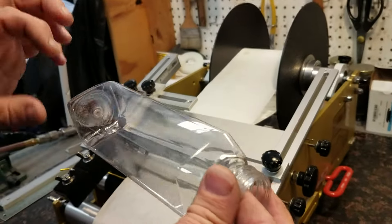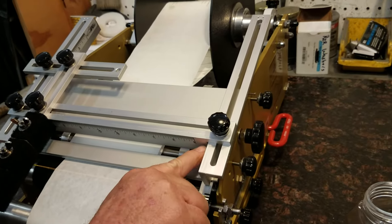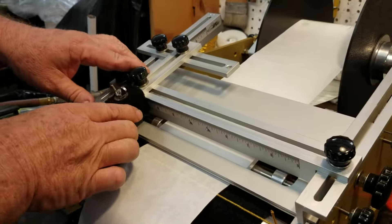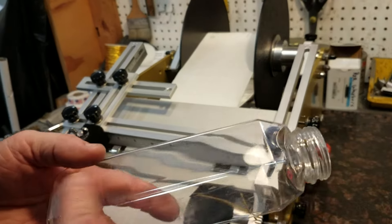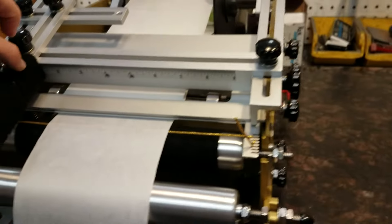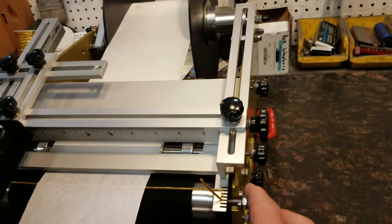In this video we're going to be putting a front label on your square juice bottle. The setting on each side is six and five-eighths. The back roll of labels is set in the middle, which dictates how far up the label sits on the bottle — you'll have to set that on your own. The Velcro is lined up with about one and three-eighths, and the cord is in the second notch.